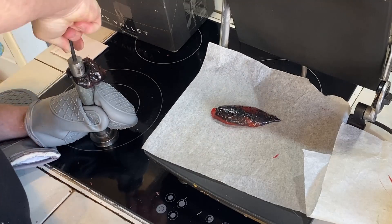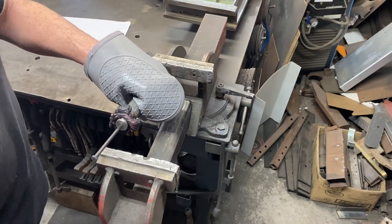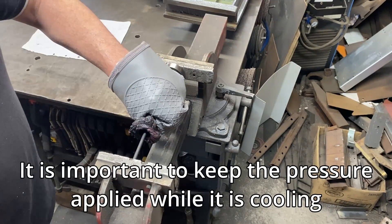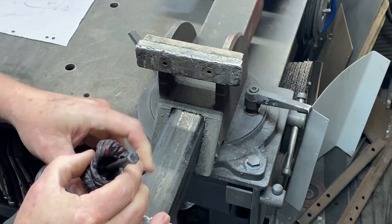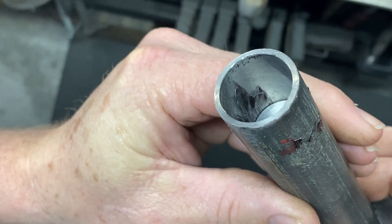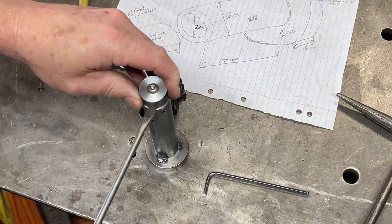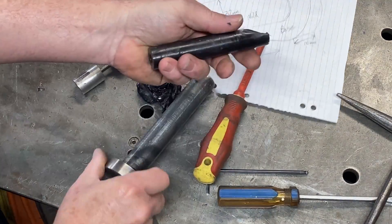I've got the plug and I'm pushing it down with that now, trying to get as much as I can in there. Then I take it to the garage and put it in this extremely big vice and add a lot of pressure. I did notice the plastic shrunk a little bit so I had to keep going out there and winding the pressure up on the vice. The mold and plastic are now cooled off, so I need to get this piece of overflow taken out. I use a chipping hammer and that came off relatively easily. The plastic had come up between the plug and the inner wall, which I did expect. I used a screw to jack the plug out, then the bottom screw comes out so I can push out the blank — it came out very easily because the overall diameter had shrunk a bit.